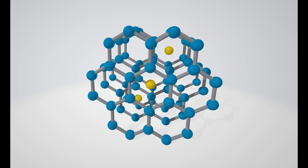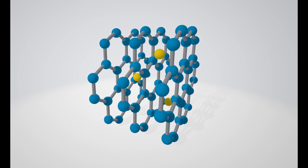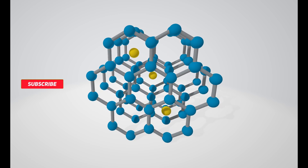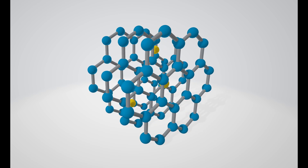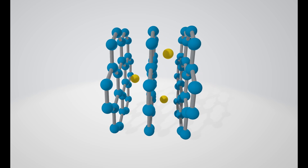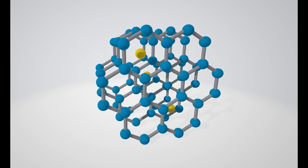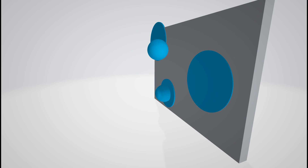The anode in a typical lithium ion battery is made of graphite. Graphite anodes store lithium ions between their layers at an atomic level in a process called intercalation. The layered graphite intercalation structure is bulky in comparison to the lithium ions it stores, which means extra weight and lower energy density. An anode-less battery cell is a type of battery cell where the typical graphite anode material has been removed and the lithium ions bond directly to the current collector, eliminating the bulky intercalation structure. We'll refer to the process of lithium ions bonding with the current collector and then layering on top of each other as plating.